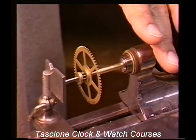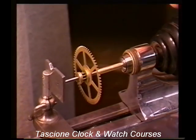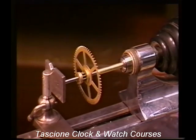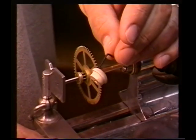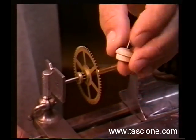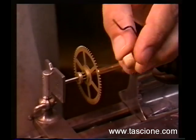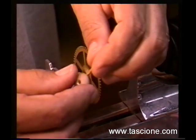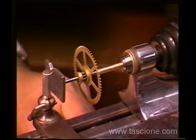For clocks, this is great — you don't need to be all that accurate. You can get more accurate and spend more time developing your tooling, but you just don't want to spend all kinds of time and money on it right at the beginning, because it will really discourage you. Anyway, I've made up some dogs out of regular old plugs from the tool — that little magic center finder that we made. All this is is the handle from the same bag of plugs, and what we have here is what's called a dog. I've made a few different types here, they just took a few minutes. They're self-explanatory — I'll show you in a second how they're put together, very simple. I'm going to pull this down and put some on there so you can see exactly what's happening.